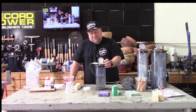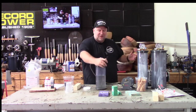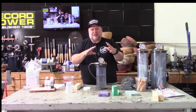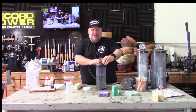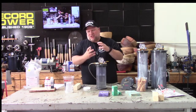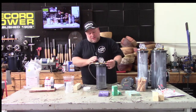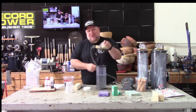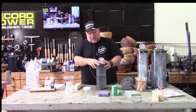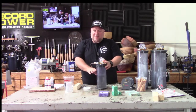Well, so generally, that's a good question. So generally, you would turn off your vacuum pump and leave it closed, right? And that'll kind of slowly let it creep in. And I think that does a better job than if you just turned off the nozzle and let all the air in. You'll get that initial swoop, but I don't think it'll fill as much as far as density. So it might take several hours before the lid will actually release enough vacuum just seeping over time. But then you could after that, yeah. But it's always best to have it enough.